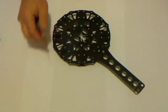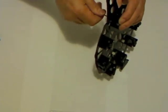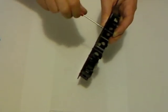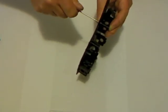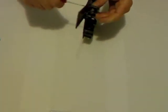Right. Okay, cool, that's one. Now, sometimes you can find when you do this that the screws do bind up like that one did. Nice. This one didn't quite tighten up because the pin's spinning inside the Delrin block.